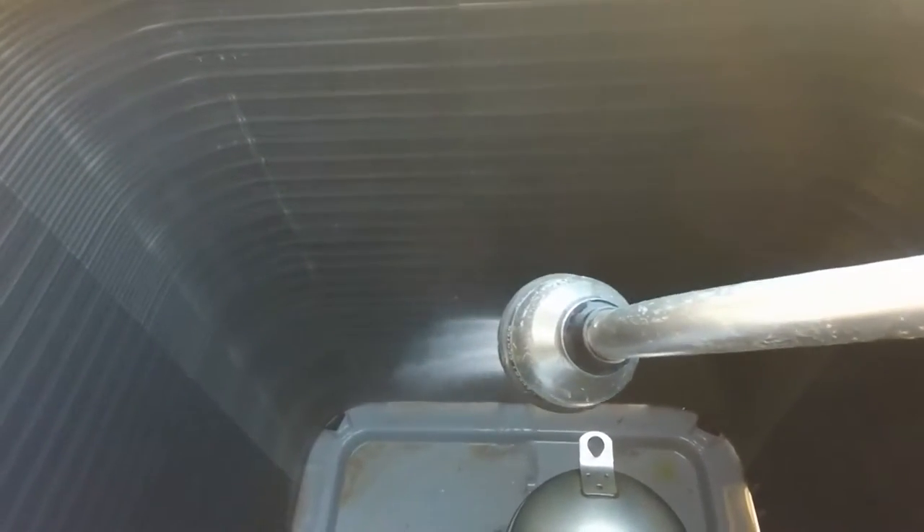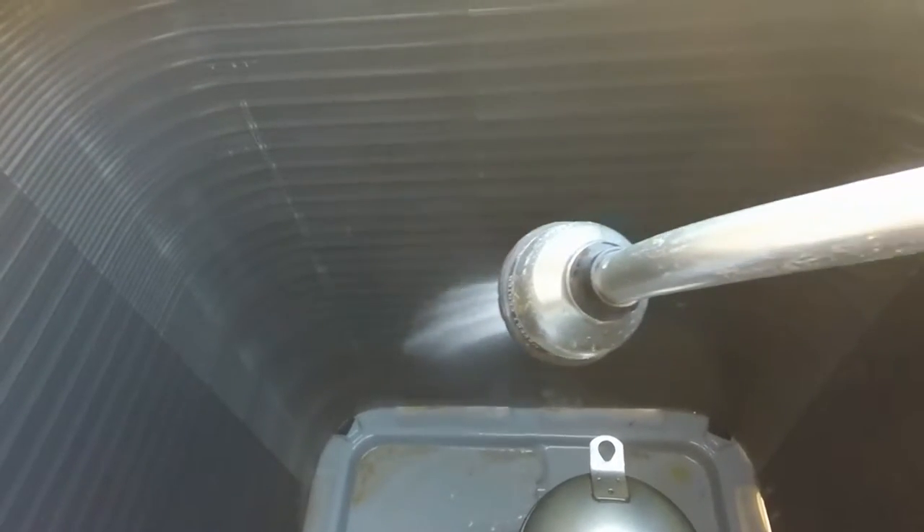While I was in here, I also cleaned the condenser coils — it's really easy to do. All you do is start from the top and work your way down. That way it gets all the dust out of your condenser coils and fins. This should be done pretty regularly. If you live in a real dusty, dirty area, it should be done quite often — at least a couple times a year. You can do it from the inside or the outside; I'm just doing it from the inside since I have the fan grill off right now.